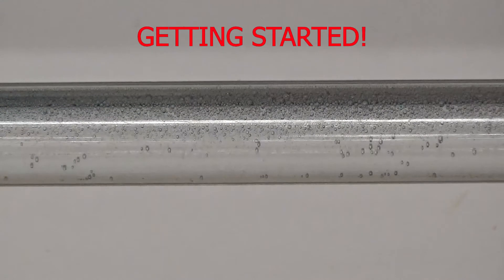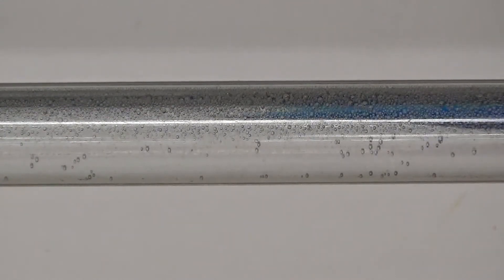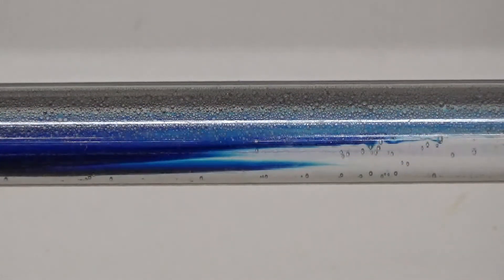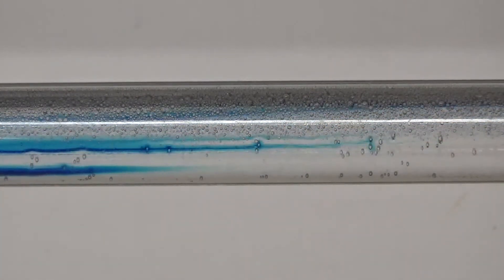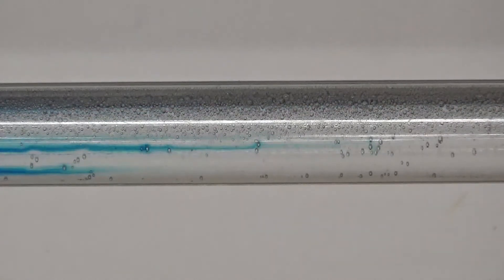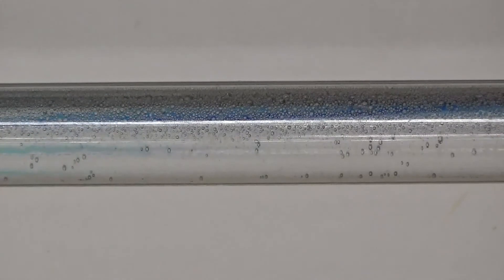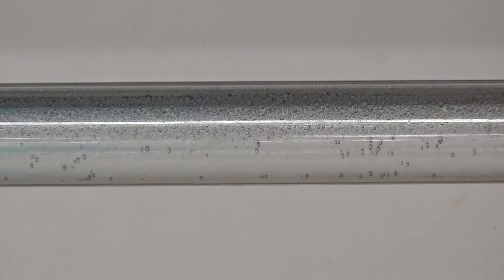At a very, very slow flow rate, I'm going to gradually introduce a nice stream of dye into the flow and then pulse the dye. You can see the front right after the bell mouth — the flow is not fully developed yet. The advantage of having a horizontal Reynolds apparatus is that the student can very easily walk along the length of the tube and observe the velocity profile as it proceeds down the tube.